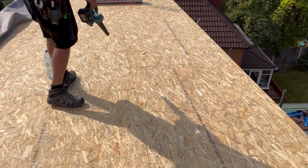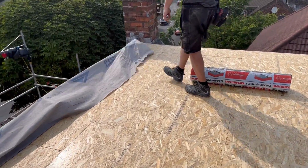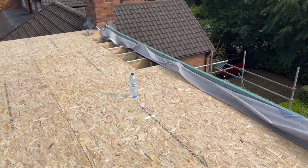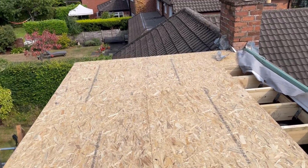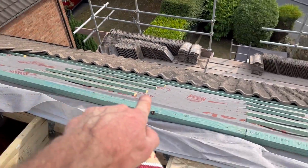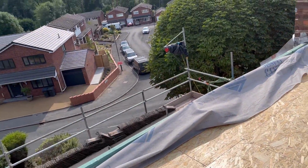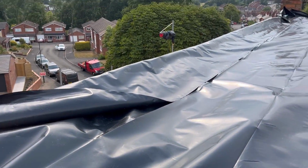Anyway. Okay, so we didn't film the deck going on the roof because one, it's too hot and the cameras are shutting down, and also it's too hot to mess about and not get this on because of the storm due tomorrow. We've got half a sheet to go in there, but it's gone 5 o'clock now, so we're going to get the plastic on here now, all over, battened onto the sides. We've got a roll of the damp proof membrane, put it over the top temporarily, nail it onto the top here, down the sides, across the front, and that's us sort of watertight. We've had a ridiculously warm day today. I think everyone's had enough now, so we're going to get this done and then we'll go home. So there's our plastic all down, battened in for the evening, and we'll come back tomorrow and start it all again.